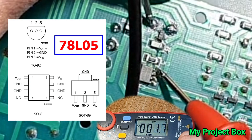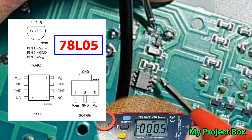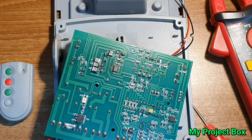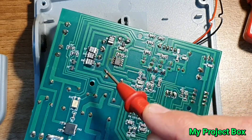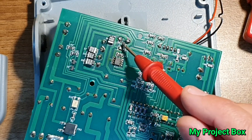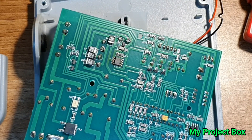That's strange — you should be seeing the 27 volt DC on the input of this regulator, and if it's being fed by the supply from the transformer we should get 5 volts on the output. It seems there's no connection from the supply to the regulator input — maybe via a transistor somehow, but I don't see the point of that. I think I can just make a wire link from the supply to the regulator input, with or without a resistor.